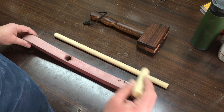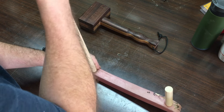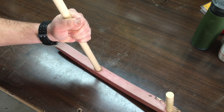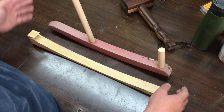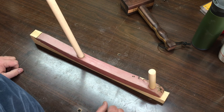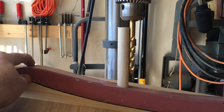That's why we need these pieces of dowel. We're going to take a dowel and put it in both the front and back holes — presumably both will be at the same angle, but that's not always the case. The reason we saved this cutoff was to hold the new rockers as we drill, but also to help set the drill press to the proper angle. So I've taken the rocker with the dowels in it, put it inside the cutoff, and used that to set the angle of my table. Even though I know that's not the right size bit yet, I know we're at the right angle.